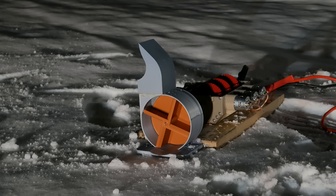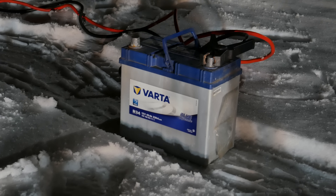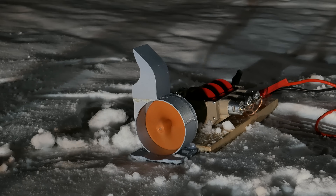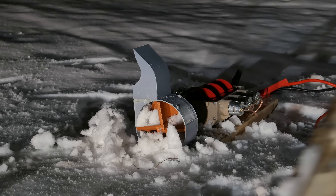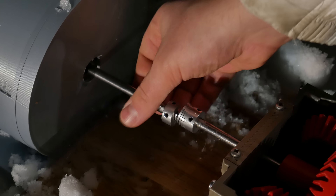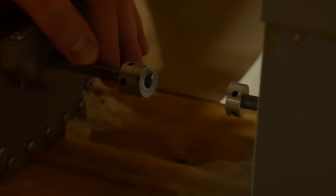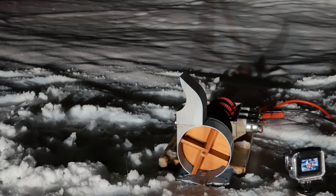So I designed and built a snowblower — though it's designed only for testing purposes and is not suitable for real-world applications. I powered it from a car battery. When I powered it up the first time it looked fine, but when I threw snow at it a second time it broke — the coupler snapped in half. Thankfully it was easy to fix; I just swapped it for a slightly stronger one and we were back in business.